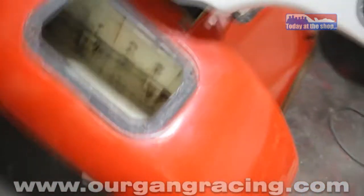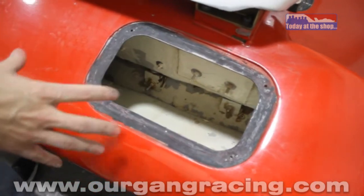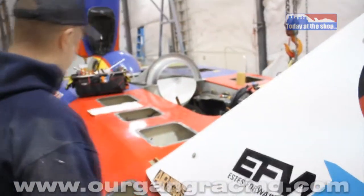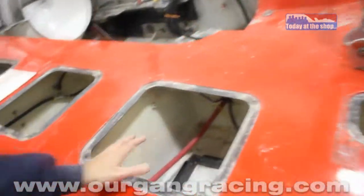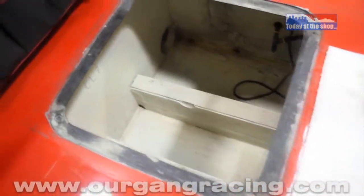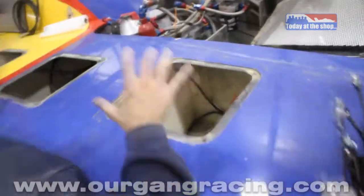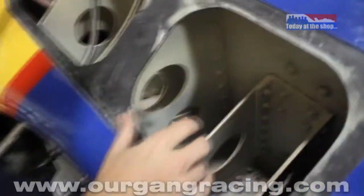Now, unlike the other side of the boat, the left side canoe doesn't have anything mechanical in it because all the steering system is on the right side. So basically this is just dead space — batteries here, nothing in this compartment, nothing in this compartment, nothing in this compartment. More structure here in the skid fin area. You can see all of the aluminum hardware that we have in here. We also have a water out line, which you can actually see as the boat's running, that comes from this dash eight line.